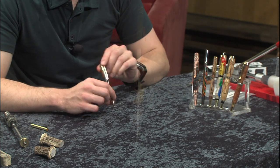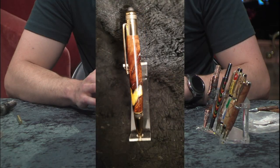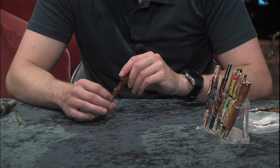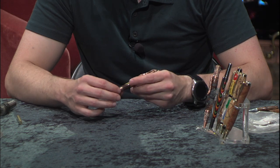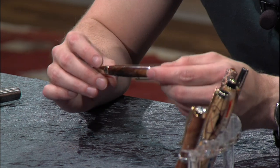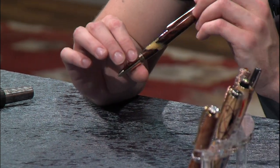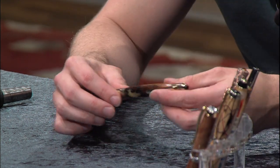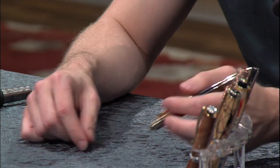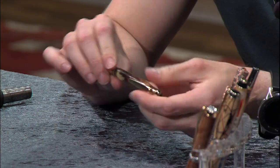Here is a Cortona pen that has both a twist action and a stylus. It features hickory and a gold and white resin that sealed the hole where a knot would have broken through. For a final sealing and full coat, I covered this with a few coats of CA and gave it a high luster polish at 12,000 grit to make for a remarkable showpiece that also has high functionality as a stylus or as a writing pen.